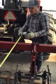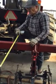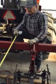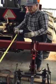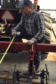Whatever does the job, you have to do. Sometimes this organic matter won't flow through. You have to raise fenders. You have to change things. And when you do that, you may have to slow down. But you always work toward that ideal speed, which is 4 3/4, 5 miles an hour, somewhere in there.